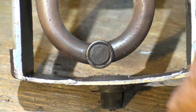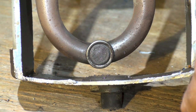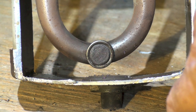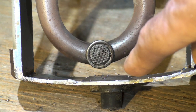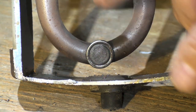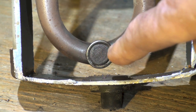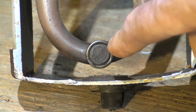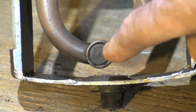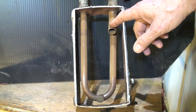The hole is calibrated to be small enough that any liquid refrigerant or oil going into it would not damage the compressor. This is how it keeps the accumulator from filling up — it constantly feeds a small amount of refrigerant through that screen and through the hole to the compressor.